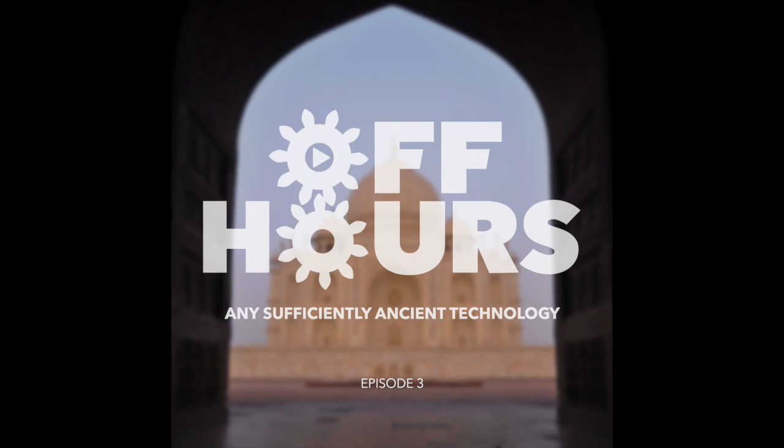In the jewelry world, we primarily use a technique called lost wax casting, and this technique is thousands of years old. Other than slightly more advanced materials and slightly more accurate ways of heating things, the process hasn't really changed dramatically. So with lost wax casting, you start with a master model of some kind. As the name suggests, it's typically made out of wax — it started out being made out of anything essentially combustible, something you could carve into the thing you eventually wanted in metal.